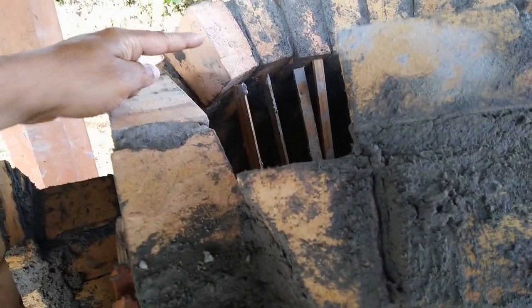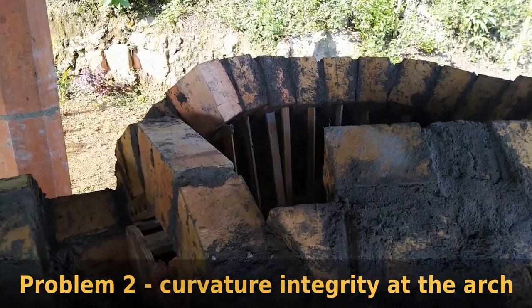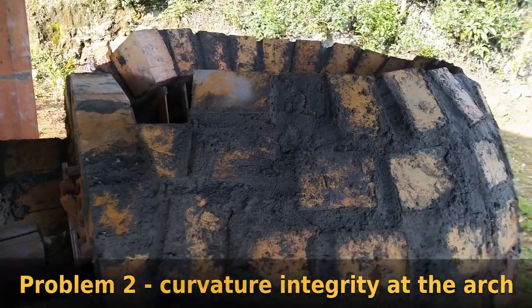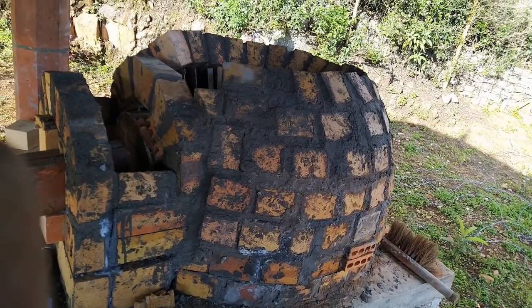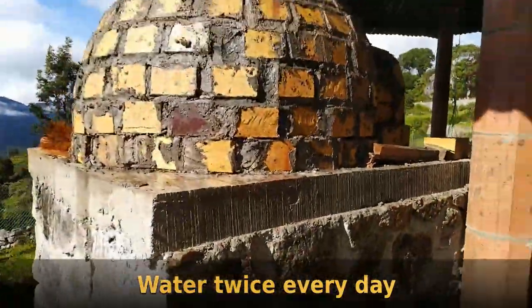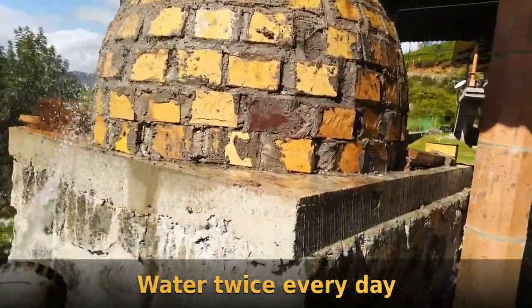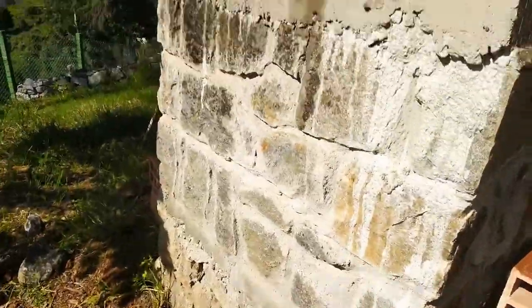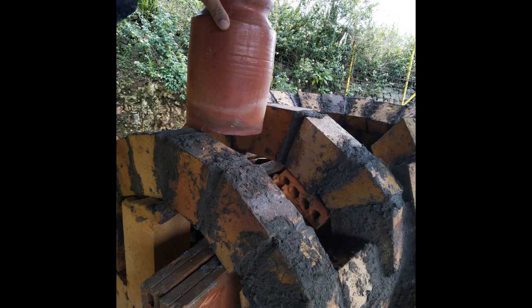The problem I'm showing with my hand is the curvature of the topmost layer — it's almost circular — but the arch itself is flat and straight. How do you join a flat structure to a curved structure? I looked on YouTube and couldn't figure it out, so that's another problem to solve. Here I'm watering the concrete as it sets — this is important, you've got to do it twice a day. Concrete only sets properly if it's wet, so in a hot place put jute bags over it to keep it damp.